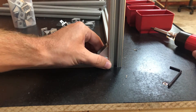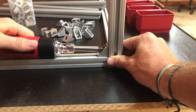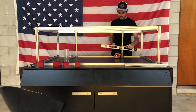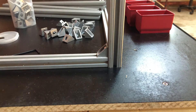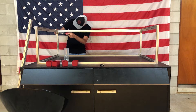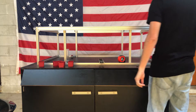Something I did to save money, which I immediately regretted, was using some leftover 1 inch by 1 inch extrusion that I had lying around for the vertical supports. It mostly worked for the outer supports, but for the inner supports the brackets were giving me issues because of their orientation. They also required different fasteners, and it just made everything a little more annoying. Other than that, putting this together was pretty simple and it turned out to be decently rigid. I still might come back in the future and add some more supports to it, but for now it'll do just fine.